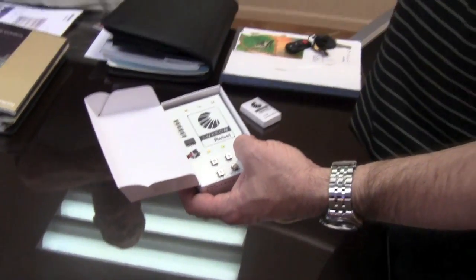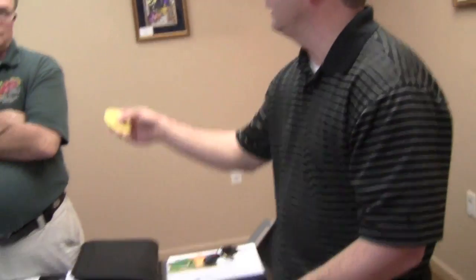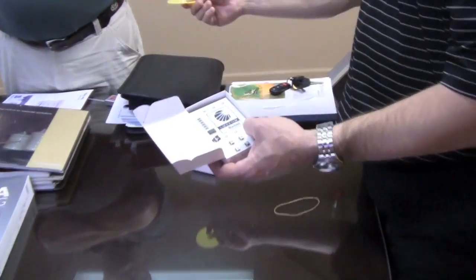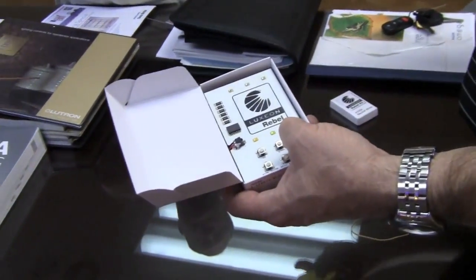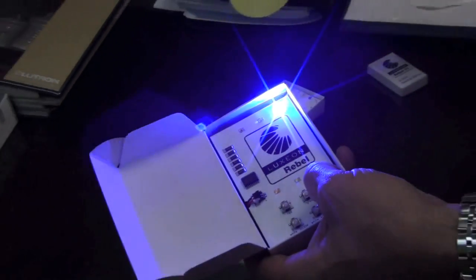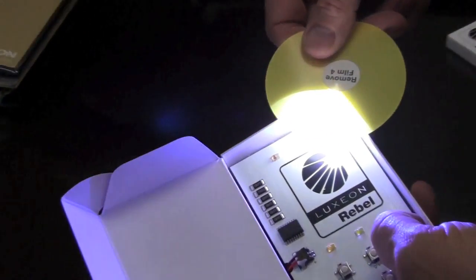You've got to increase the current to get the same light output, and then since it's running hotter, you've got to add better cooling. And you're really overdriving it. Which is permissible as long as you don't exceed certain thresholds, like a junction temperature. Then the opposite is you take the same blue and you pull the phosphor directly off of it.